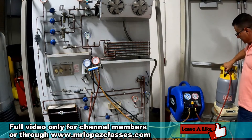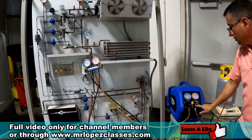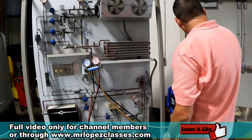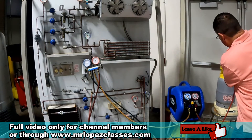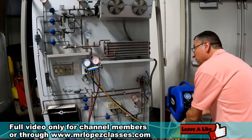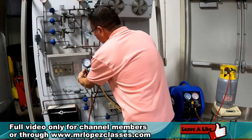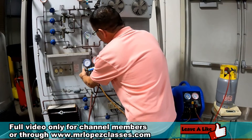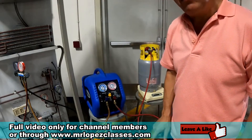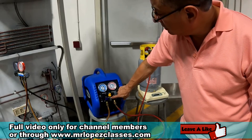The first step is to open the valve on the cylinder. Open both valves on the recovery machine. After that, we are going to bleed a little air in the system. Right now it's bled properly and we are ready. We are ready to open the suction valve. Open the suction valve and we are going to start the system. The system stopped by itself, so we are going to turn off the power, wait a couple of minutes, and then start the system again and switch it to purge.